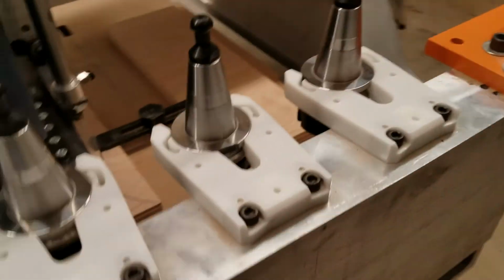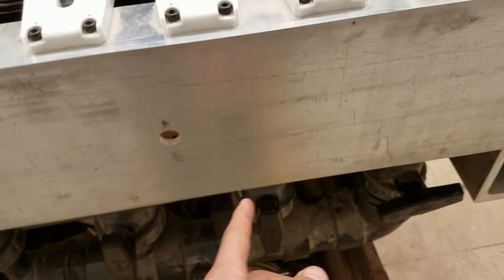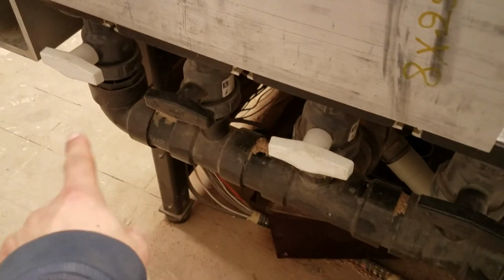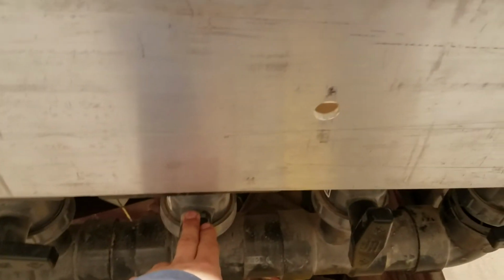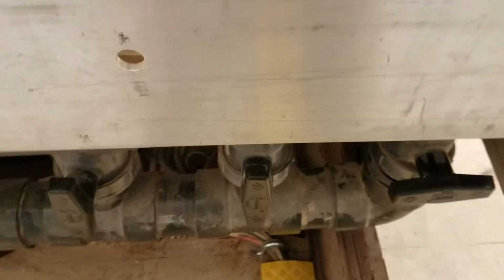So for that, what we do is open the air channels underneath where your piece of material is. The channels run the full length of the table. In this case, when they're horizontal, they're closed. So these are all closed. This is open, which is good because that's underneath where we are, as well as this one. So those are both open and this one's closed again. So that's good. In general, you don't want all of them to be closed when the fan is on, because then it's trying to suck against all these closed things.